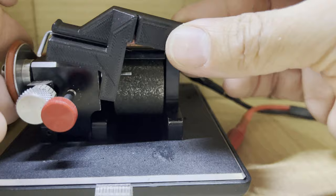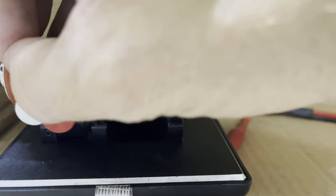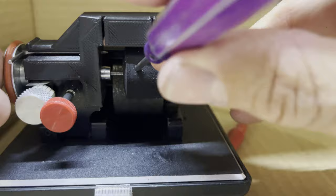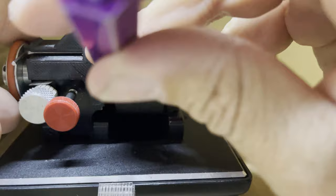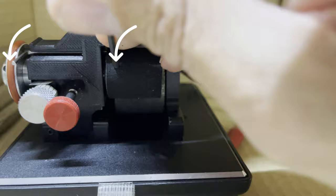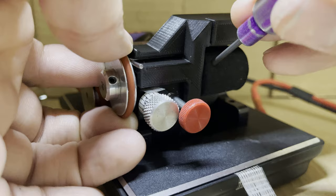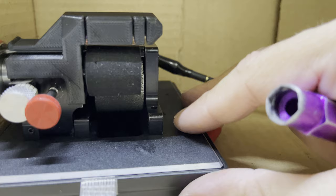I'm going to hook the trimmer onto my tyre truer — hook that over, clip it down, and it's solidly clipped in. Then I attach my wheel to the axle, pushing it all the way onto the boss and lining it up with the grub screw on this left-hand side. The grub screw on the pulley is lined up with the grub screw on the wheel or hub — that way I know where it is when I've finished trimming.